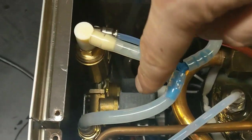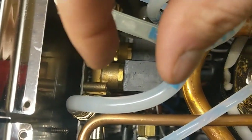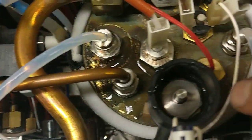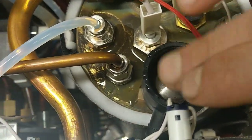Okay. In this case, the solenoid valve with the problem is this — it is the water charge solenoid valve. It stays open. Practically, it's locked in the up position. And as we can see, the boiler is full of water — it's completely full.